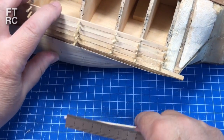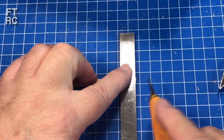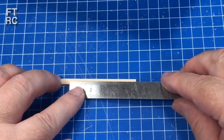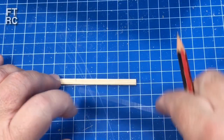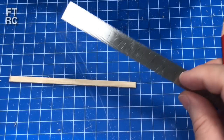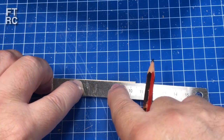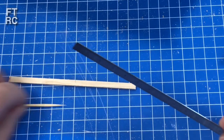So it's just a simple matter of finding a bit of waste planking that I'd cut off and tidying it up. Cutting a wedge — it's never a good idea to cut into the thin end because your knife will slide off. What you really need to do is cut away and out from the thin end. I place the rule on there and draw across that way — if my knife is going this way it falls off the wood; coming the other way it'll bounce and I won't get a nice tapered end. So by going the right way, scoring gentle scores, it starts to free fairly quickly.